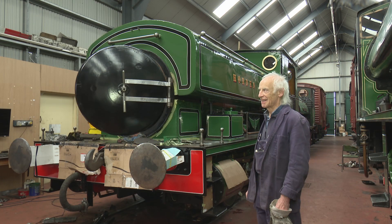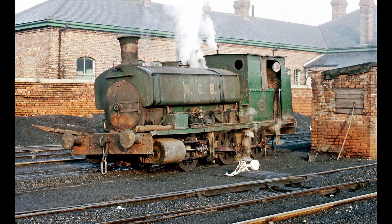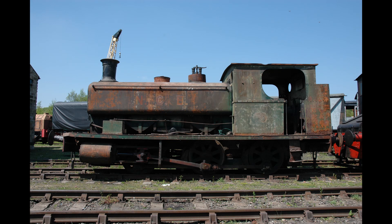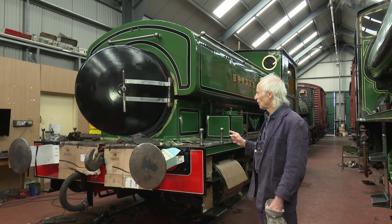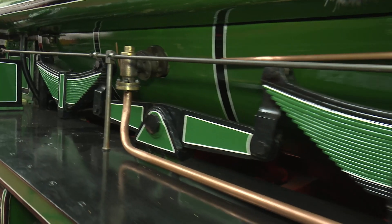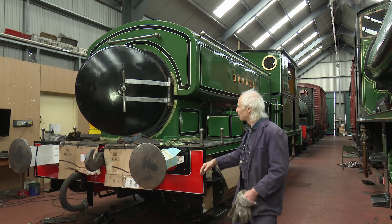This is the one we've nearly finished — we've been on it a bit longer than expected, about five years. Horton was acquired back in the 1970s after having worked for 69 years down at Shotton Colliery. Unfortunately we couldn't keep it under cover very long, and it ended up outside for the best part of 40 years, so it looked like little more than a heap of scrap. A few months away from being completed, we've had all the bearings replaced, new suspension, new brake gear, boiler repaired, new buffer beam, new smokebox door.